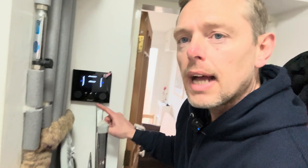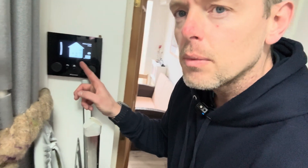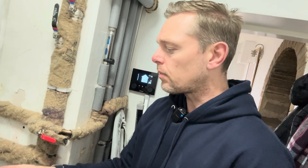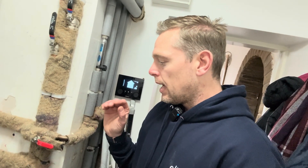On the control side I've set this up differently. It was set up as dual zone - a bit of underfloor through to the kitchen and through to the extension with a thermostat, and the Madoka doing the radiator side - all on the same weather curve. I don't really see the need for dual zone, so I've put it on a single zone. When the underfloor thermostat calls, it just runs the underfloor pump without turning the machine back on. We'll leave the underfloor thermostat as an overheat limiter, especially in the conservatory, set at 21 degrees.